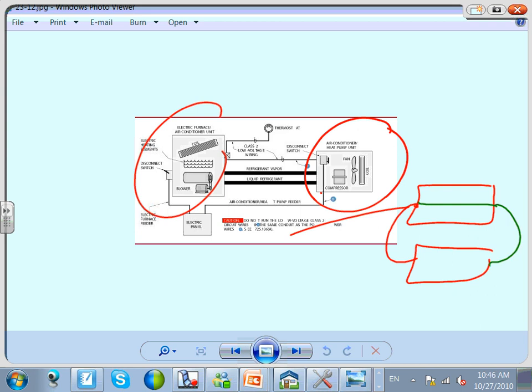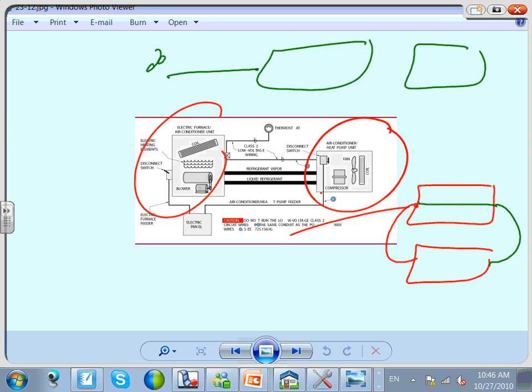No, they don't do that. What do you mean, you're running in series? No, not in series. Here's one, here's another. I want to wire these two. Bring the circuit here. It's a 20 amp circuit. Then move through it out to here. Do you do that? No, well, you can, but you're not supposed to. They're not in series, they're just moving through. Everything is in parallel.